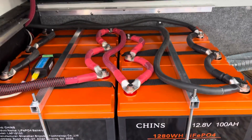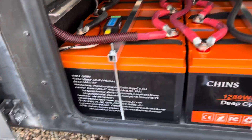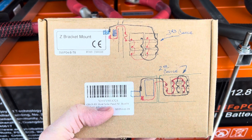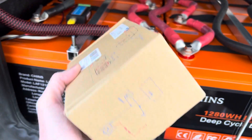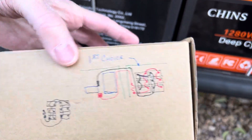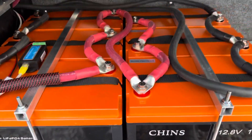Let me discuss what this wiring looks like — it's a little unconventional compared to most. Before I started, I drew on one of my boxes and came up with several different methods of wiring to pull the positive off from one end of the bank and the negative off the other end, so the batteries are evenly loaded and the cable lengths are appropriate. There's also a cooling fan I'm installing on the electronics side because the inverter and charge controller get a little warm. I kept drawing and eventually settled on this design.